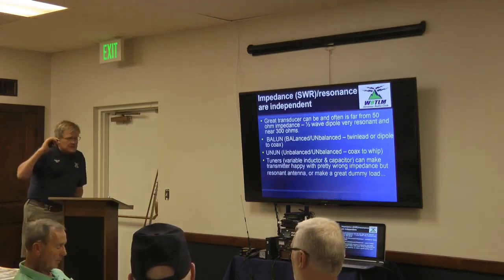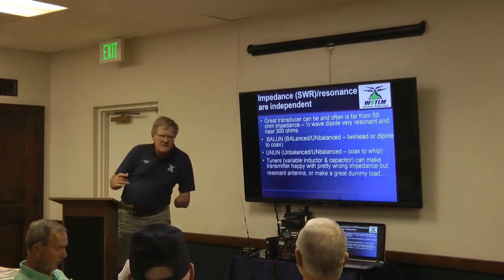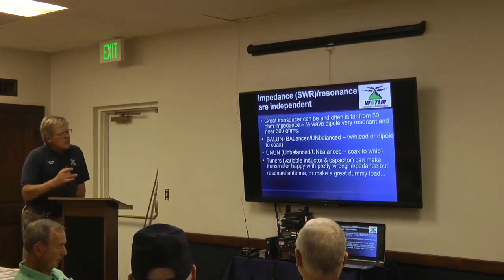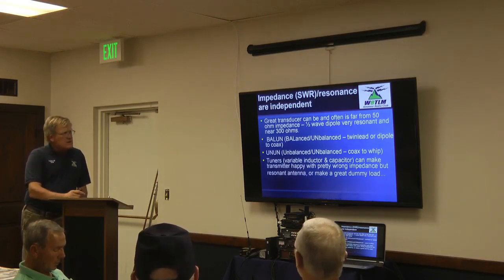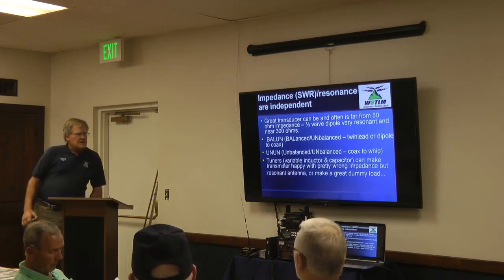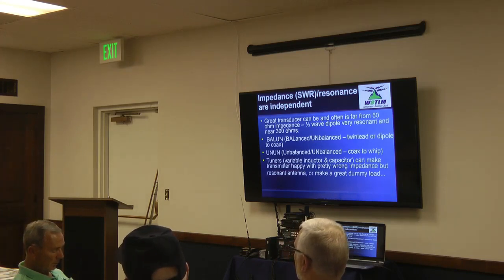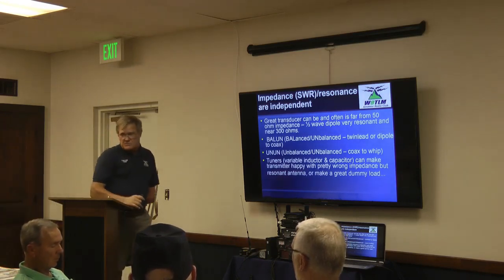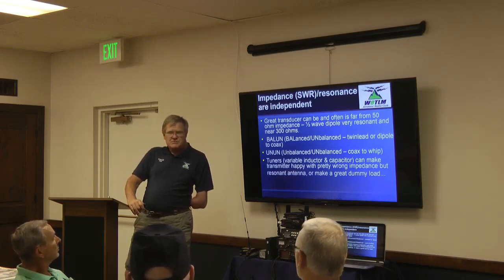I talked about impedance/SWR and resonance being independent. And they mostly are, sort of. But you should think of them as being independent. A really good transducer, like an optimum dipole, is very resonant, a very effective transducer, and is around 300 ohms impedance at the resonant frequencies. That's just the way RF works. Your transmitter wants 50 ohms. So it's not happy transmitting into a dipole. You have to do something to match the two.